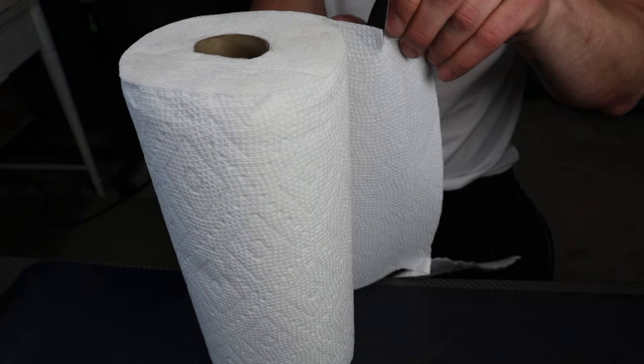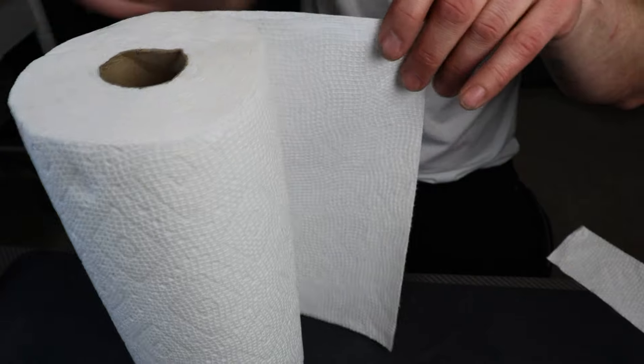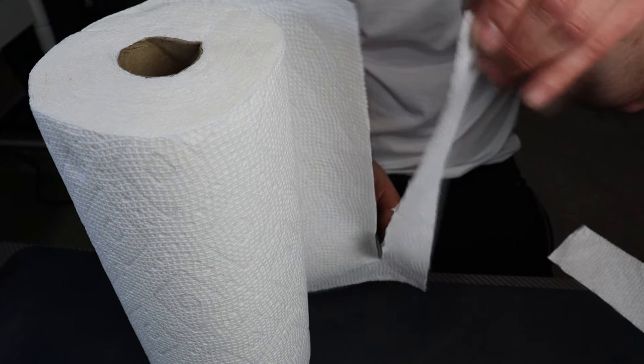Another quick tip: ceramic plates. Make sure you have them — get a rod and a plate. These are like a multi-tool for knife sharpeners and work really well at removing a burr. You can switch to your ceramic for burr removal and it'll remove a burr very easily, leaving a nice clean apex. I can't recommend using a ceramic enough when deburring, and you can use them for many other things as well.